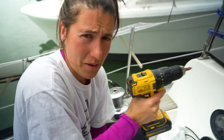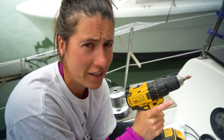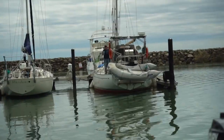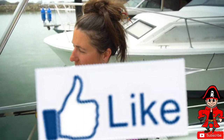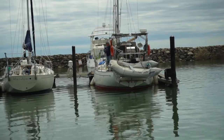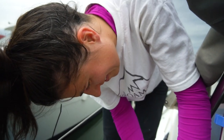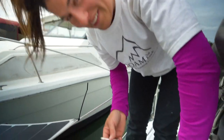I am fixing up some holes — we've got a bunch of holes in our deck, so we figured we're going to seal those with epoxy. Hopefully the resin is still actually good. We're sealing all the holes from the screws, putting some epoxy back in, and hopefully no more water leaks. The only thing I can actually get in those holes to clean them with acetone is q-tips — so yeah, q-tips.